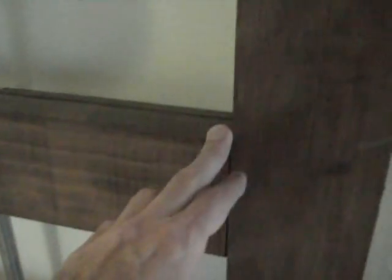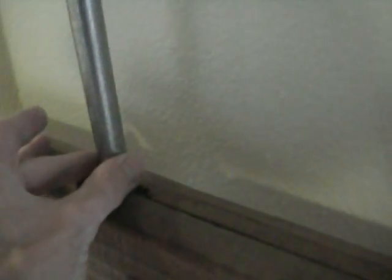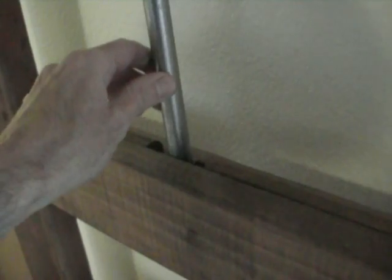These are, I think, 17 and a half inches here. And the ones back here — I've got 2 boards, these are 26 inches. I didn't have any clamps, so I had the 17 and a half inch board and then the 26 inch board, and I made some little short pieces so there's a little opening right there. When I tighten this up, it holds this pipe in place. If I want to take the pipe out to move the chair, I just loosen up the screws a little bit and the pipe will slide out.